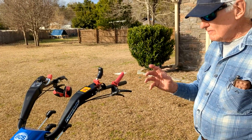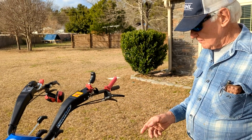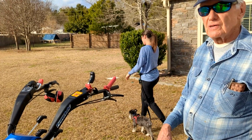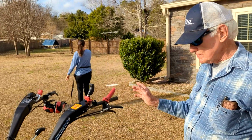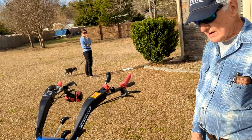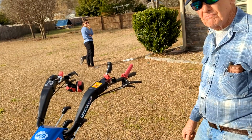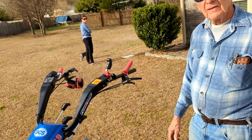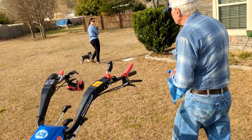If the battery ever goes dead and it wasn't cranked for whatever reason, rope start it and let it charge itself back up. Don't try to jump it off, because it should rope start. I could take that battery home with me and rope start just like it crank starts. One or two pulls and boom. Doesn't even need a battery. And the key can stay switched on.